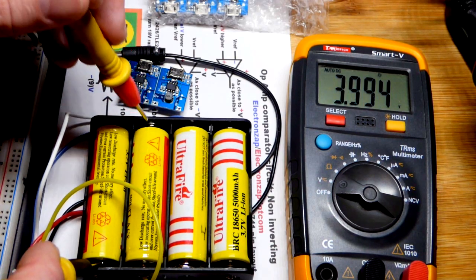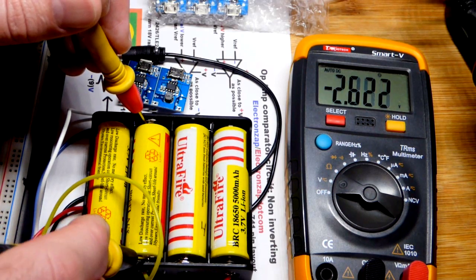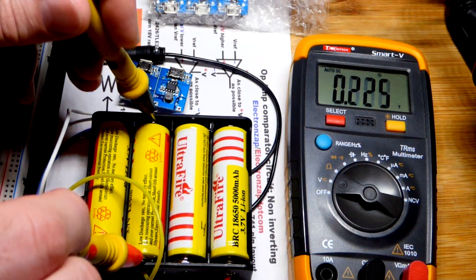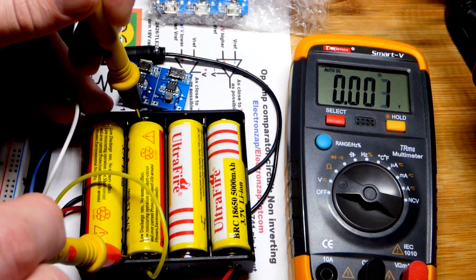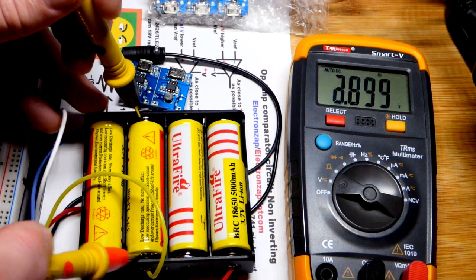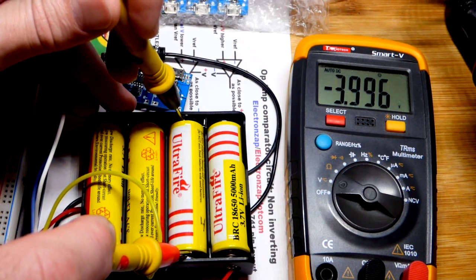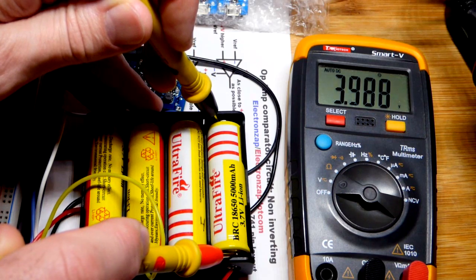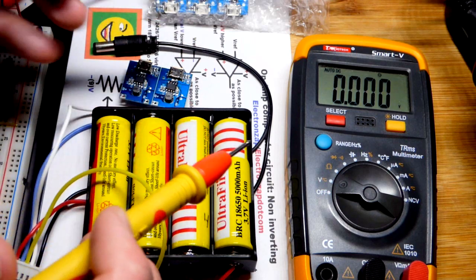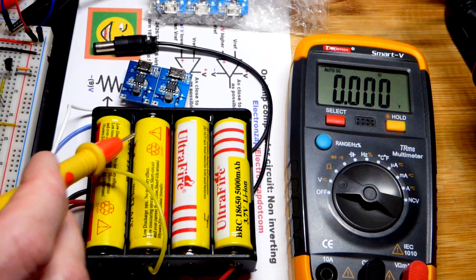You get the main power through there to the two ends, and it monitors the voltage of each cell. If one gets higher or lower than the others, it adds or reduces current to that particular one until they all line up again. There you can see we got 4 volts. If I go there it's the same voltage because there's a wire connecting there. To get this battery's voltage we have to go over here. The probes are backwards — they go one way and then the other. If you're okay with negative voltages that's fine. We finally got a connection. You can see that one is lower — it'll be negative, but that's no big deal. So it's just because the probes are backwards. There you can see we got about 4, and about 4. I'm pretty sure these all charged to 4.2 volts. You can expect them to drift down to 4 volts and then they tend to hold there. So this one's probably a little less good than those.